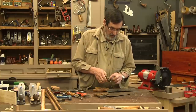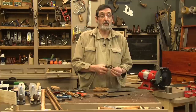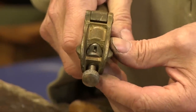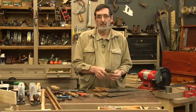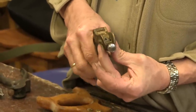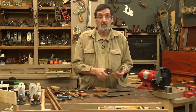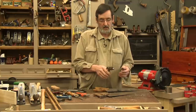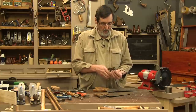This platform inside here rotates from a 12 down to a number 4. So if you have a 4 points per inch saw, normally the manufacturer's advice would be to set the anvil to number 4 and then squeeze the tooth to conform to that platform. But the problem is that's way too much set on a 4-point saw. If you go to the other end of the scale — a number 12 — that's good for just about any saw from 8 points up to 12, 14, 16, 18 points per inch. You don't really need those in-between settings, because too much set means you take out too much stock and the saw tends to waver in the cut.